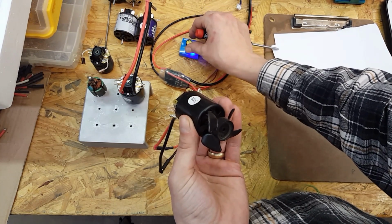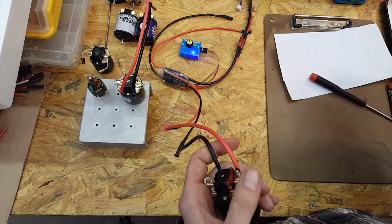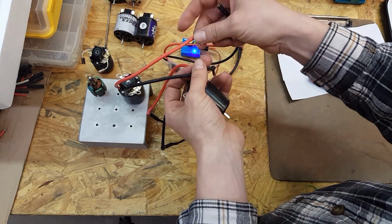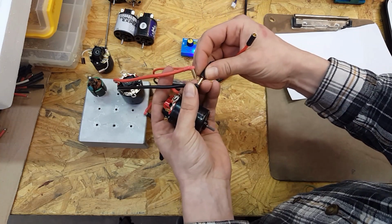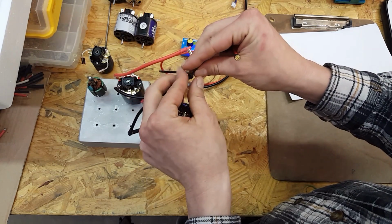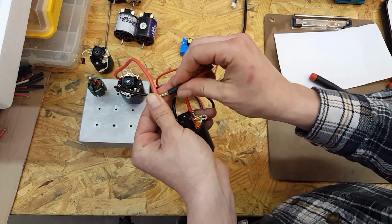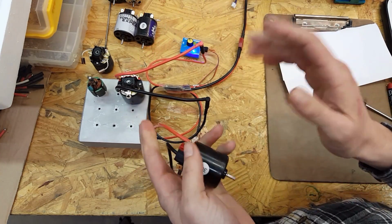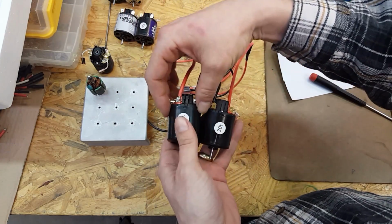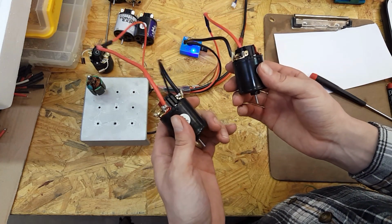Now finally, what we want to do for our fictitious motor on axle vehicle is to make sure that we have a speed matched pair. And this is important for the handling of the vehicle. You want to make sure that your front motor is at least as fast as your rear, if not slightly faster. This is so that the rear is not constantly pushing around the rig from the back. It causes really funky handling and can really upset the suspension on these light rigs. And so we want to make sure that we have a nice matched pair.